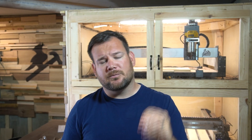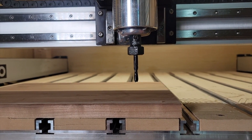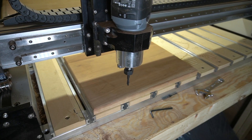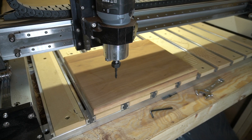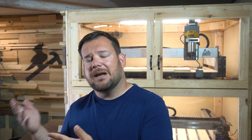A lot of people don't know that you can set your retract height, but this is a setting in whatever software you're using. Number five — and maybe my favorite — is running an air pass before you actually run your final cut pass. An air pass is when you're running a new file and don't know 100% what the machine is going to do. Instead of setting your Z height at the top of your workpiece, you set it two, three, four, or five inches above — whatever your Z will allow — and the machine does exactly what it's going to do, but up in the air. It's a great way to see what the machine will do and lower the risk of errors, especially on things you haven't cut before.